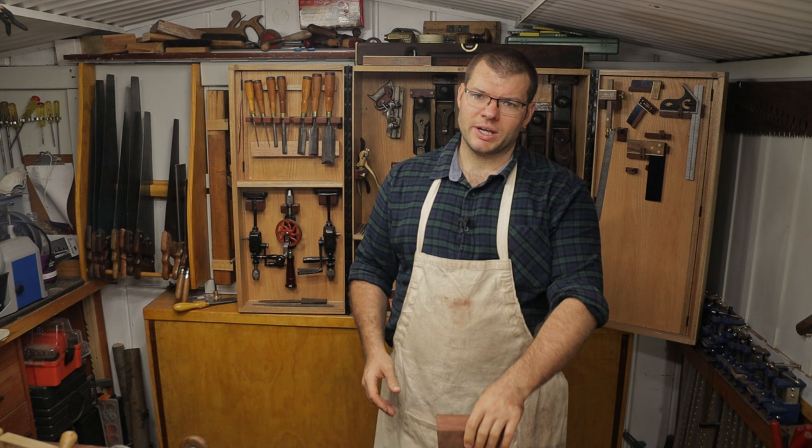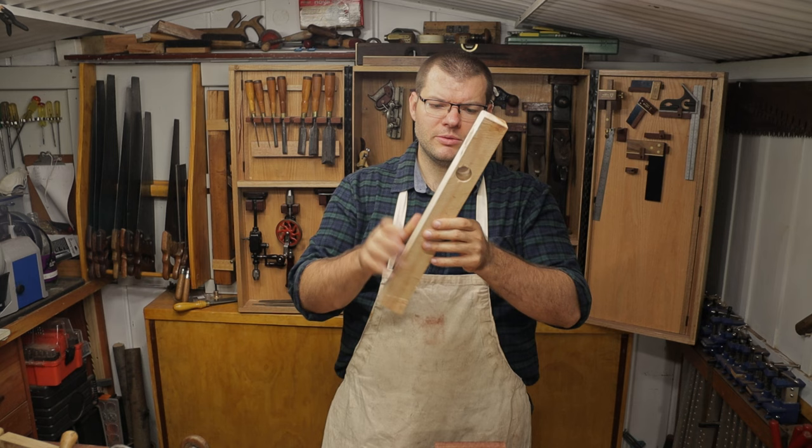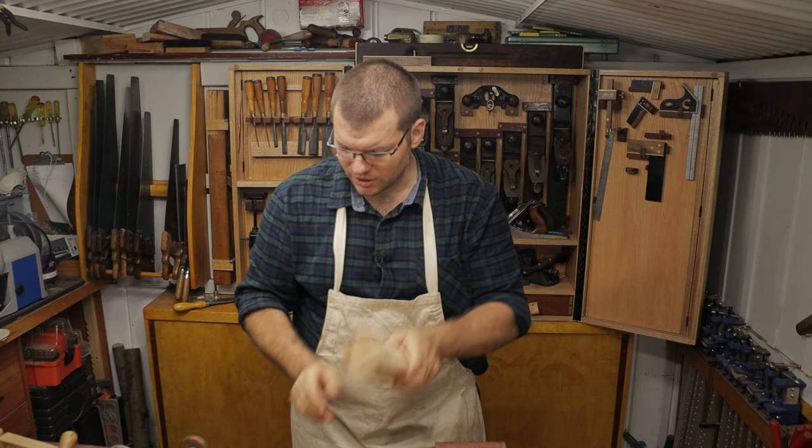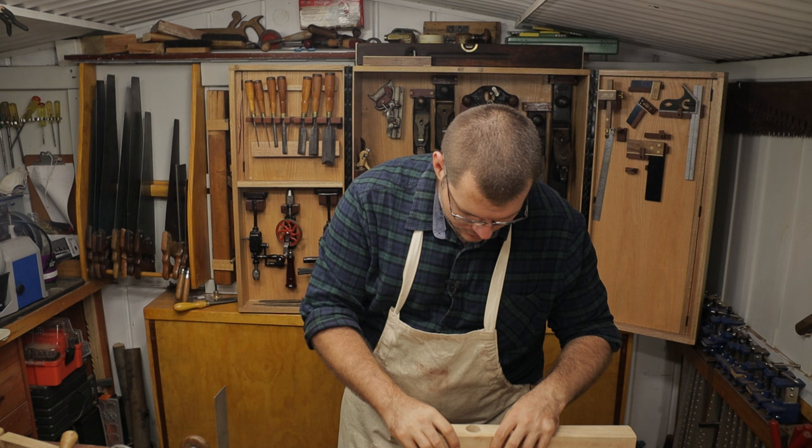The other way is to use some sort of a guide that you already know is augured square through a smaller piece of wood. Now, it just happens, I have this piece of pine here with the 1-inch hole already augured through. Now, you can use that to help align yourself, or you can use a couple of different squares and do it by eye. Now, I find this is at least the easiest way to start, that you get it where you want it and line it right up on the top here.